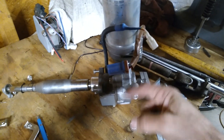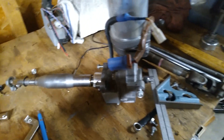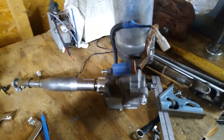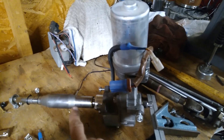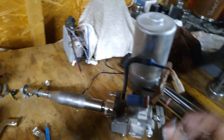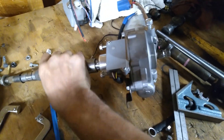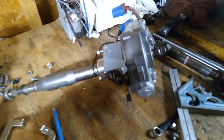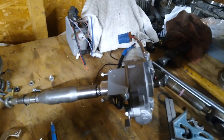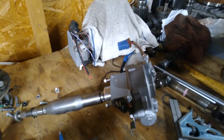When that happens, it kicks on this motor, which has a worm gear inside, and it just power-assists your steering — to a great degree, very effectively. And if this thing ever stopped working, you can still turn the steering gear through manually — it's just a little harder. So it's automatically fail-safe: if the electronics go out, you still have steering, it'd just be a bit harder.